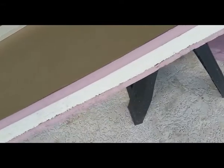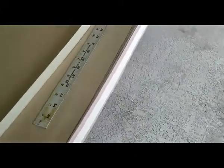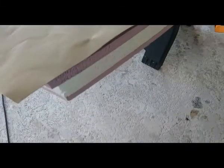The only trouble, and I don't think you can see it too well in the video, is that when I roughed out the initial shape, I tried to cut too close to the line. And as I went around the corners, the blade bent in. So although I'm to the line on the top, I've got divots in the bottom and they're way too deep.